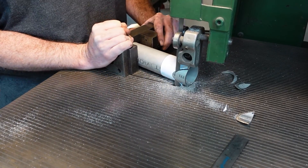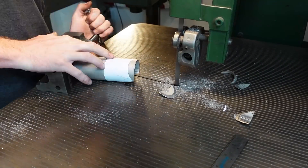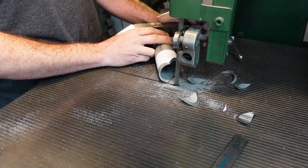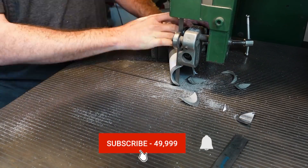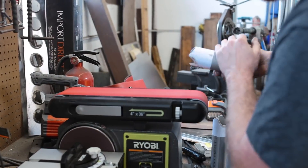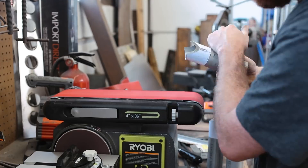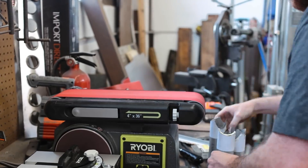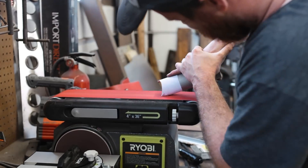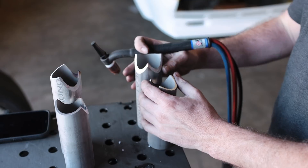I took these tubes, put them in a small vise, and one by one pushed them through the bandsaw, carefully making sure that my cuts lined up with the paper. If you guys are liking this content and want to support this build, do me the favor of subscribing — it really helps me out. Once I got all four tubes cut, I took them over to the belt sander and flattened each cut face so that they will nest nicely together, which is pretty critical. Gaps are pretty much a non-option, otherwise you're going to have all sorts of problems welding this thing together. This part of the process takes just as much time as cutting, but the payoff is worth it.